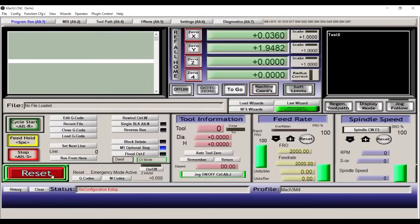If the ports and pins are correct and you still move the Y axis or X axis and the value changes in the DRO but your actual machine is not responding, then if the configuration file is correctly installed and this issue is still happening, it might be an issue of your feed rate.